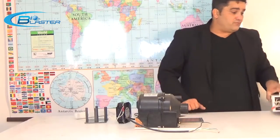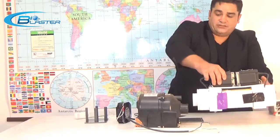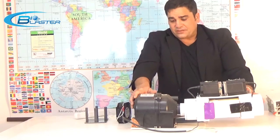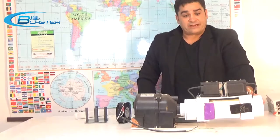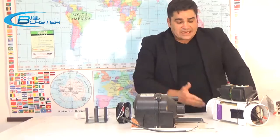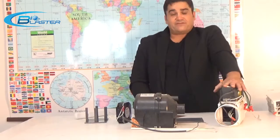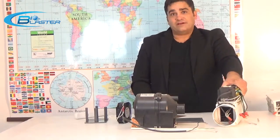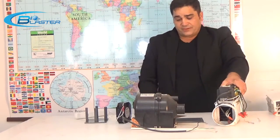This power pack, which had two transformers, went through our ozone tunnel and took the air coming out of the blower and blew it straight through the generating media, maximizing the airflow in contact with the generator cells. I went away from this design after about six months — it's now a dinosaur in our little museum of ozone history.